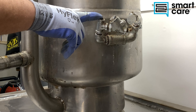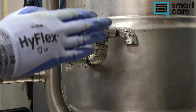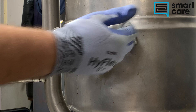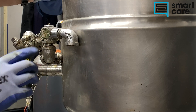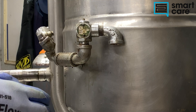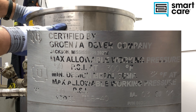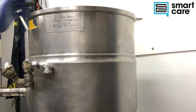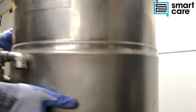If it doesn't show a vacuum, chances are there's a leak somewhere in this part of the kettle. The most common area for leaks is the relief valve, but the relief valve should never be plugged. Because this is a pressure vessel, it's critical that the relief valve be able to vent if the pressure gets too high. In this case the relief valve has a rating on it, but we can't actually read it — I think it's 50 psi. Looking at the data plate, we can see 50 psi at 300 degrees Fahrenheit is the maximum this vessel is rated for. So as we're working with it I expect some fluids to come out, but let's tip it over and look in the bottom.